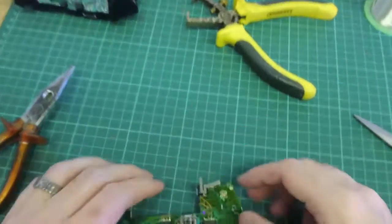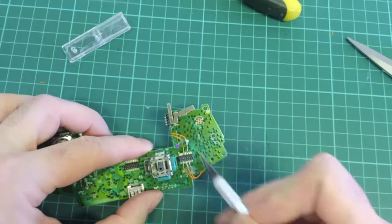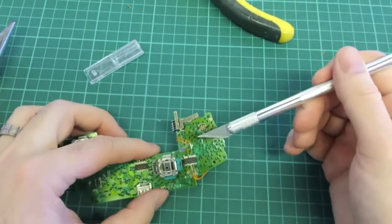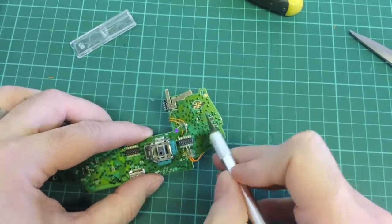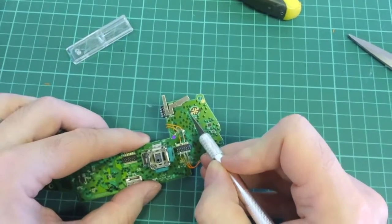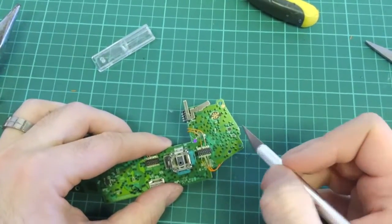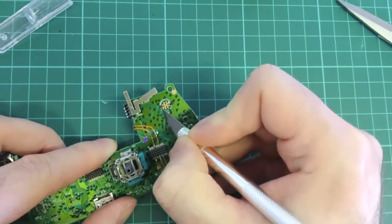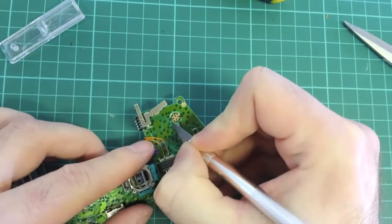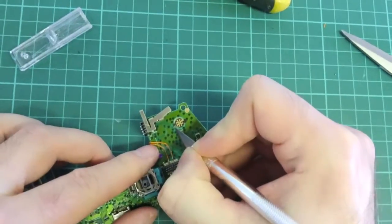We are nearly there. Last one we need to make — this is your B button connection. Just take a craft knife or exacto knife and scratch away a tiny bit of the bottom of this black carbon contact pad on the left of the button. Scratch up to half of it away, but leave some carbon — don't scratch all of it away or your B button won't work. All you need is a little bit of copper showing so that we can make our solder connection to it.